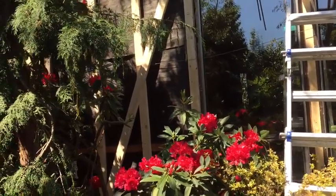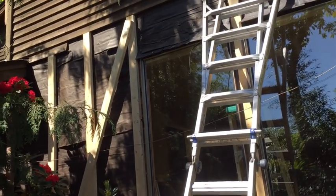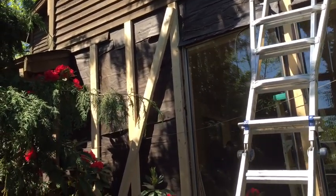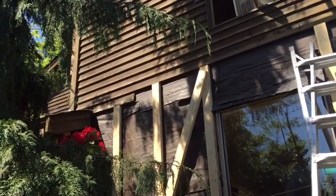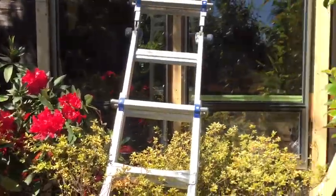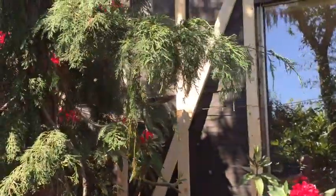Okay, so now if you need additional bracing on the outside, here's what you do. You find the existing outside wall studs and you sister up two-by-fours, and you nail the heck out of them. You leave that space in between where you're going to put the beam, and then you nail the heck out of them.